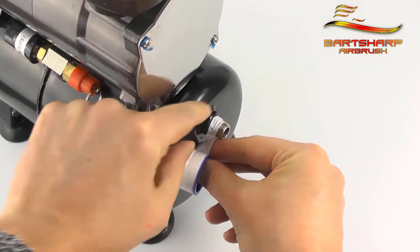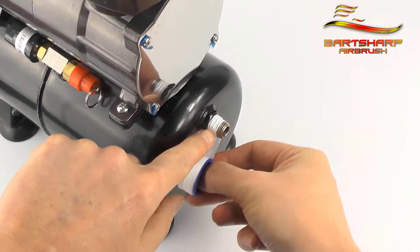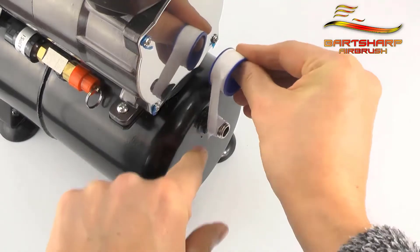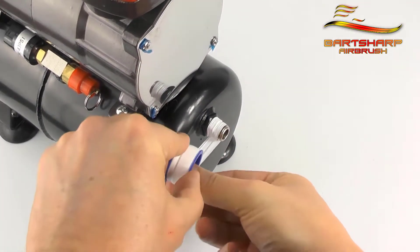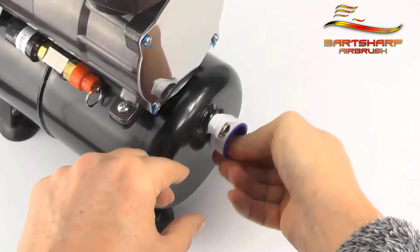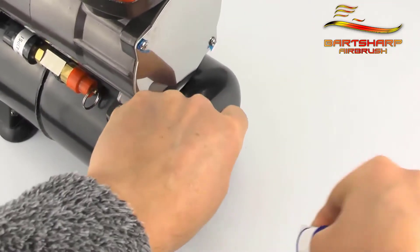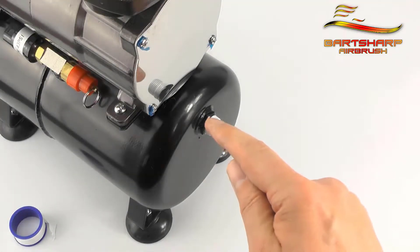When applying PTFE tape, always always work in a clockwise direction. If you don't, and you're screwing your item on, it'll just unfurl the tape and it will be a disaster. You'll notice I started at the back of the air connector and I'm working the tape forward, applying pressure so that it goes on as smooth as possible — giving the best opportunity for an airtight seal. What I'm trying to do, as shown in the diagram from the packaging, is build up a cone shape with the PTFE tape from the back of the air outlet towards the front. Just keep going round putting the layers on, and when you feel you've got enough on, break it off. There's no exact science on how much tape to use — it'll be trial and error. Just make sure you work clockwise and from the back of the fitting to the front.